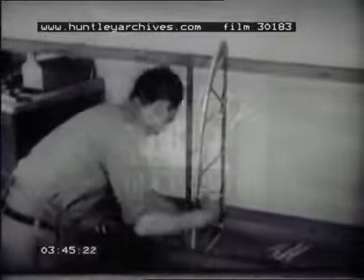The rib spar strip at the end of the rib must make a clean straight joint across the top edge of the spar. If the leading edge notch does not exactly straddle the guide wire at the tips of the notch, use a block plane to reshape the spar end of the rib. It still doesn't fit. Be careful not to remove too much. The fit now seems satisfactory.